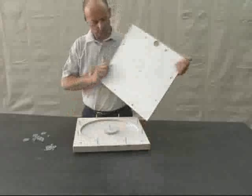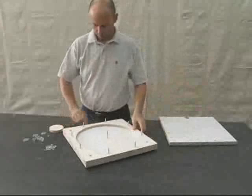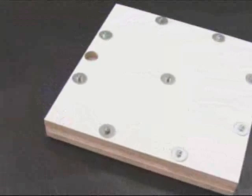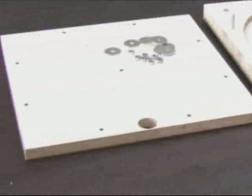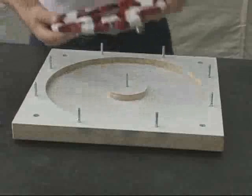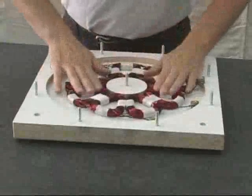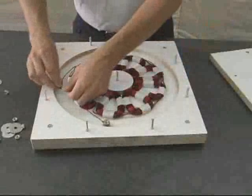For convenience, this is the stator mold that we offer from our website. Being a do-it-yourselfer, this is something that you can easily make. We use a laminate material which allows the stator to release easily after molding and provides a great surface finish. The coil assembly should fit snugly around the center core, which will keep it in perfect alignment inside the stator.